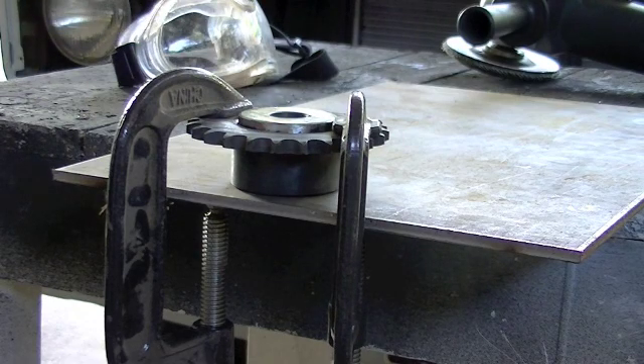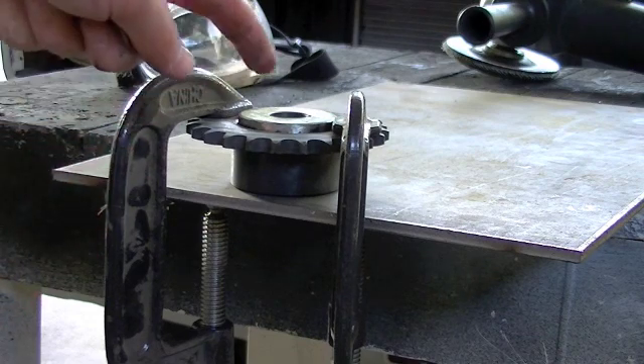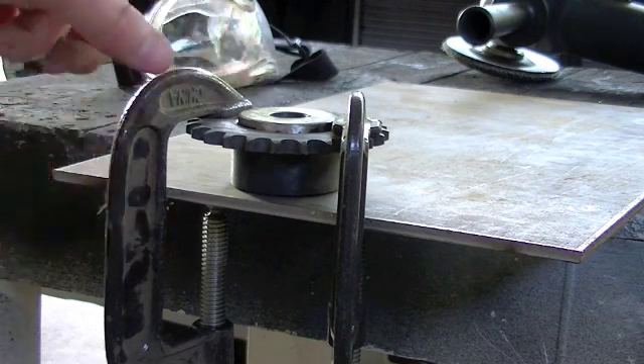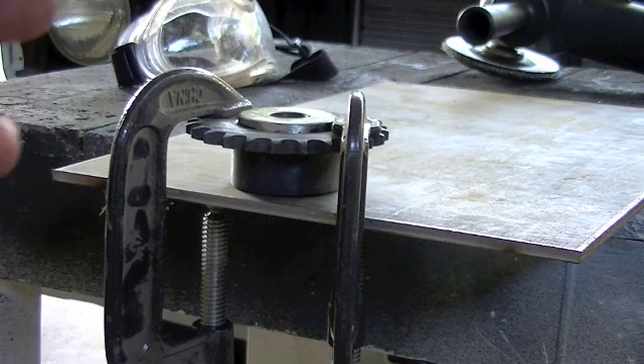I've been pre-heating for a few minutes. I'm not going to get it super hot — it's not totally necessary to pre-heat it, considering this isn't a super high-torque application. The welder should be able to get enough heat in there for good penetration. But if you have even just a propane torch, get in there and heat it up. You can even put it in the oven — turn it on to 250 or 300, put it in for about 10 minutes, then bring it out and weld it. If you have a way to do it, I recommend it.